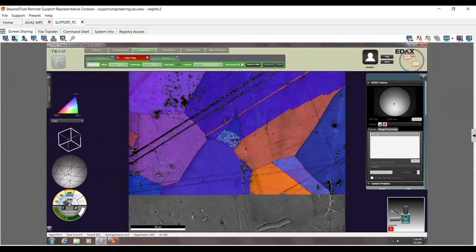And here you can see, again, there's an inclusion and a scratch, and the scratch is not indexing. You'd also notice that sometimes the orientation of the scratch will give you an idea of what's going on with the diffraction. These scratches that cross-cut let the diffraction signal out, while the diffraction tends to be a little bit more absorbed by the sample depending on the orientation of the scratch. In general, this is a pretty beat up sample, so just one of those small things to consider.